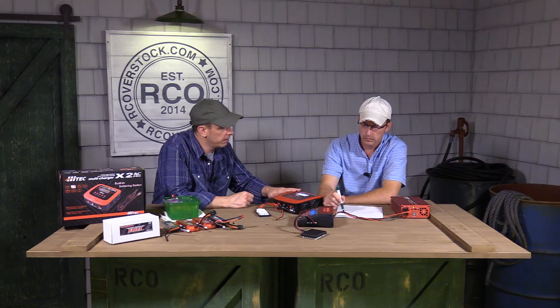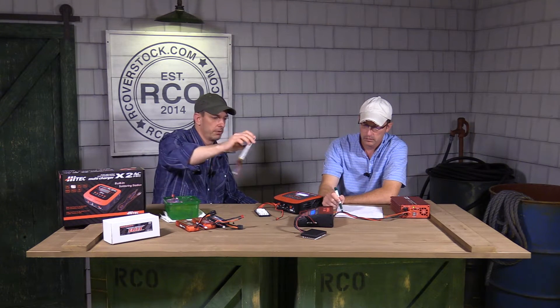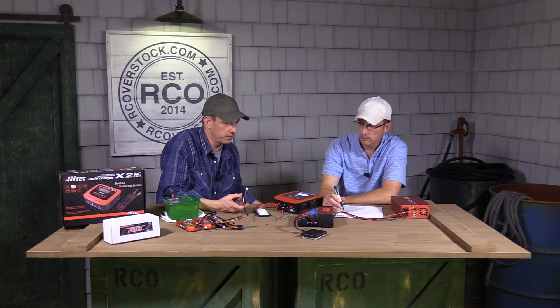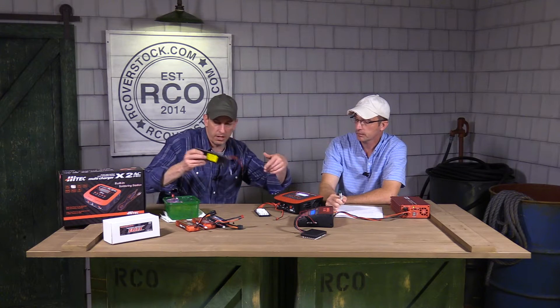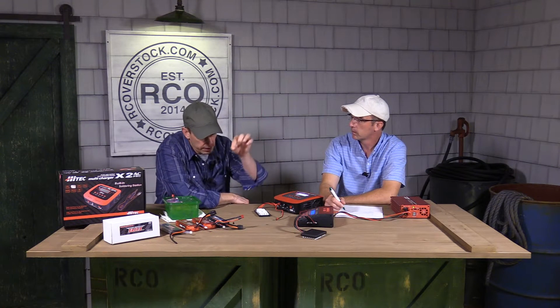How can you use the numbers? The numbers should relatively be low. We took a brand new elite series pack, ran it on the Thunder Power checker and also the X2 — got a one milliohm variance between the two, showing one to two milliohms, which is right down there. That's fine for a brand new 55C pack. But you've got variance between chargers. We're trying to get a line on a dipstick that doesn't have any writing on it. Draw your line on a brand new, healthy pack, and then measure from that point forward using the same equipment — that eliminates variables.